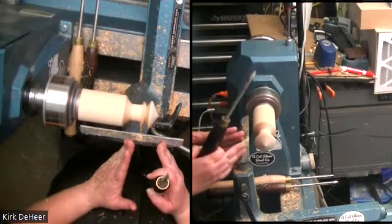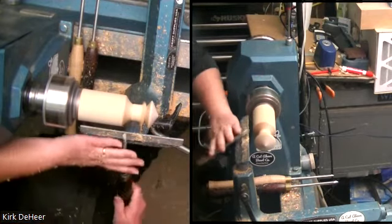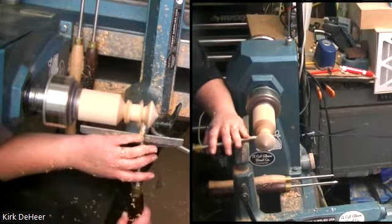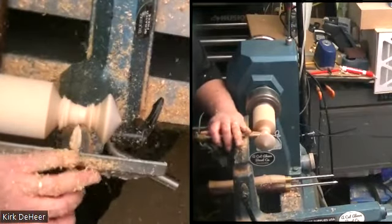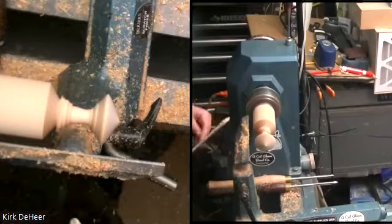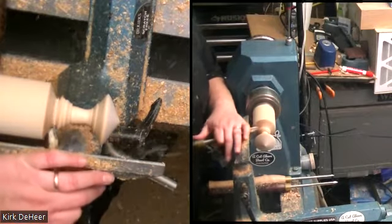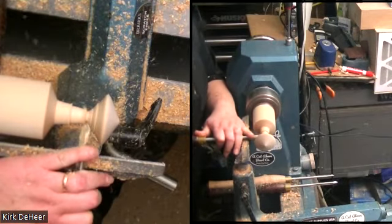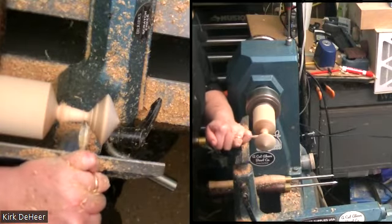You want to look at the head of your top to make sure you've got a nice angle and it looks like a top — it should look right to you. We're removing more material to make our spindle. You can have all the fun you want — you can make your spindle as wide or as narrow as you want. The narrower the spindle, the faster your top will spin. I like long slow spinners, so I leave a good size spindle at least a quarter inch wide, more often closer to three-eighths, because you get that nice long spin.